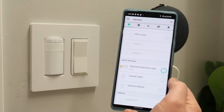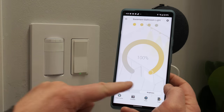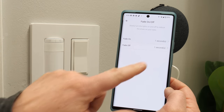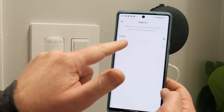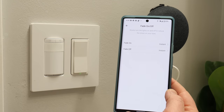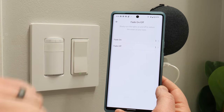This switch can do some really awesome stuff and you don't need a hub. Right now I have it set so in the daytime it goes to full brightness, but in the evening it automatically goes to the most dim level. In the app, you can quickly turn it on and off, adjust brightness, and use presets at the top which you can customize. In the settings, you can change the name and the fade on/off duration — from instant up to 60 seconds to turn on. Trying instant on shows it's much more instant; a one-second fade on is nice for nighttime.